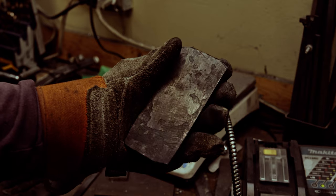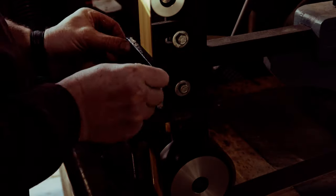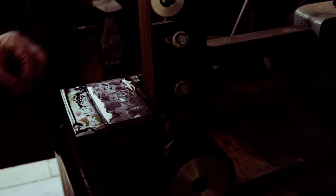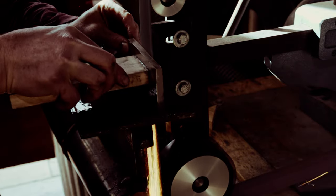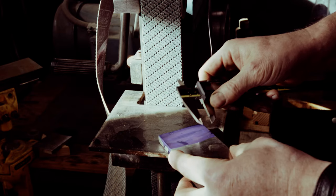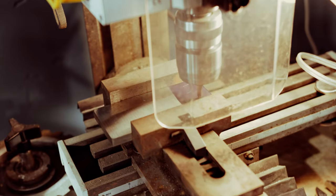This looks nice already. On the grinder, I am using an aggressive grit and try to true up the dimensions of the Beskar ingot. I want straight sides, even width and even thickness. The grinding gets the steel quite hot and I need to frequently cool it down in water. Before I can take it back to the forge for hot stamping the Galactic Empire sigil and hardening the steel to bring out the pattern better, I still need to cut the grooves on the back. I am using layout fluid to see where the grooves should be. I don't have a real milling machine and instead use my mini mill and a ball end cutter.